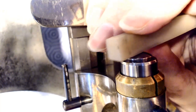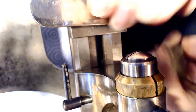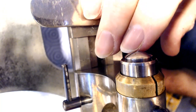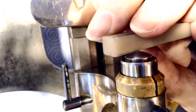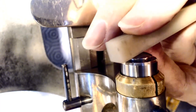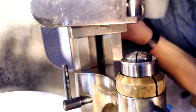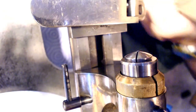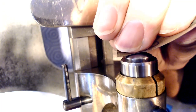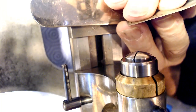Maybe if I put a bit of cutting oil on there it'll work better. I'm going to try my 400-grit diamond plate because this thing just works on everything. I'll just flatten it like that and then move it sideways — you really can't see the action on the inside but I'll show you the result when I'm finished. Back to the stone now because the diamond plate did round it off nicely, and I don't want to take too much material off.